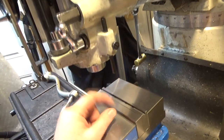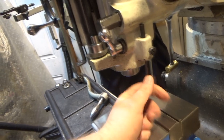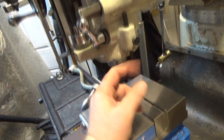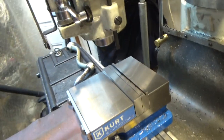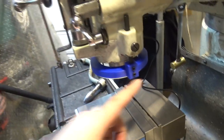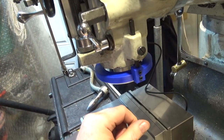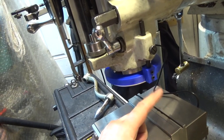Here's the rod on the side of my mill — I know in a lot of mills this casting is broken because things have hit it. I don't normally leave this rod in place, but I will now because that's where I'm going to mount this ring. It's got a flat on one side and a half-round on the other — it's probably metric, but it's pretty close to 5/16ths. I'm going to make a different rod so I can leave this part in place with the screws down and adjust it. I've got it mounted over here with the set screws tightened, and they hold it pretty decently — better than the thumb screw does.